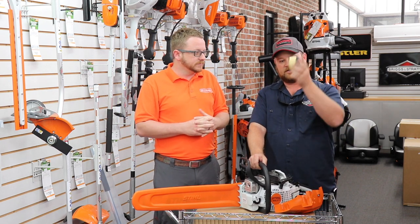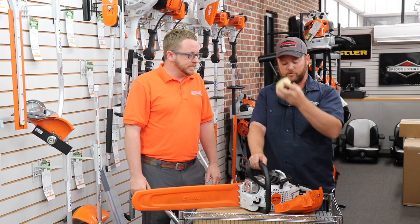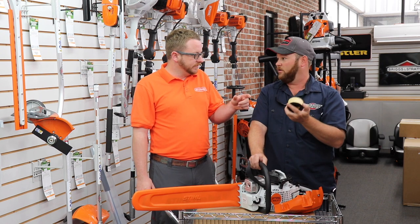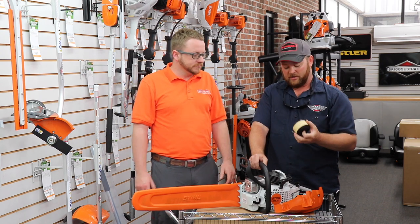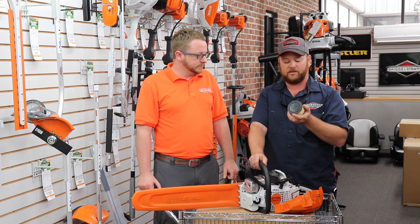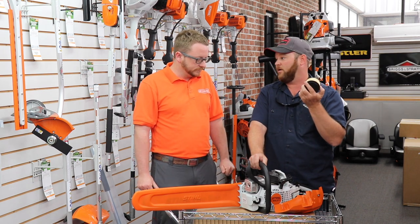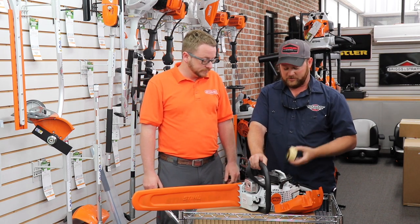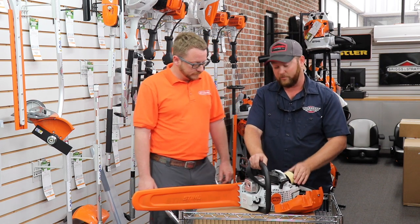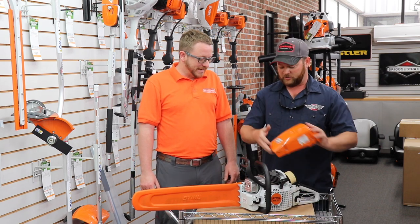The air filter on these new saws is lovely — we see this pretty much across the board now. You can even upgrade this to an HD2 filter, which is the pleated filter, and the pleated filter can actually be washed. The standard filter is maintenance-free — you don't want to blow it out or anything because you'll blow the felt out. But again, we're not going to mess with this until we see a power loss. If you see a power loss, take it out — it just twists right off. Chunk it and get your new one from your local Stihl dealer, then click it back in and reassemble.